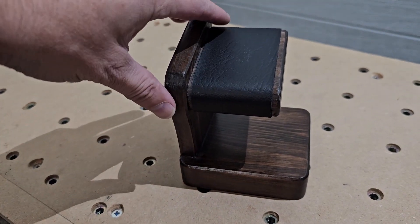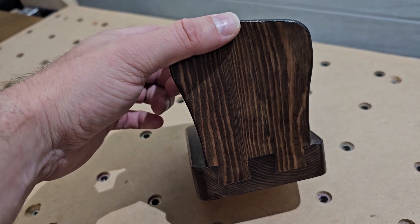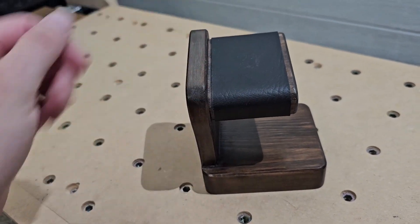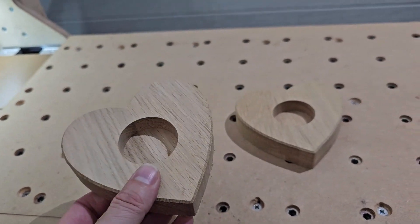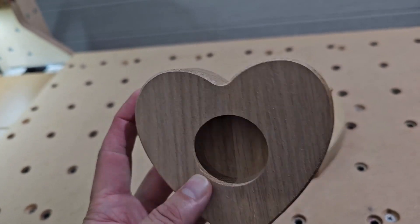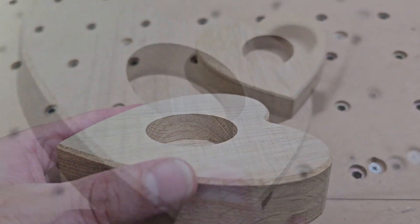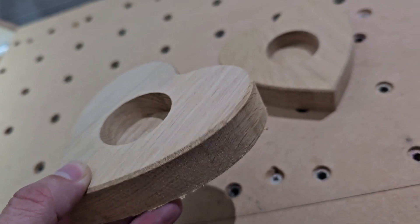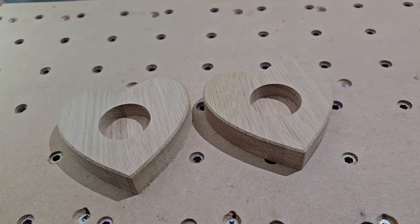This is a watch holder I cut on the machine just before the spindle died - you can see where I used that end feature to cut the dovetails on it. I'll cover that process in more detail in a future video, so hit the bell icon and subscribe to stay tuned. This other job is a tea light candle holder made in oak, shown here before sanding, cut with a quarter-inch downcut bit running at about 800mm per minute, 2mm depth of cut. I could have gone faster or deeper but I was really happy with the results, and I was able to cut six of these at the same time - something I definitely couldn't do with the other machine.